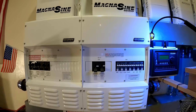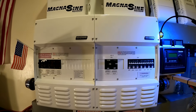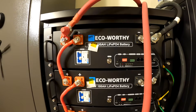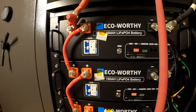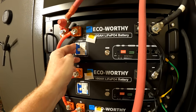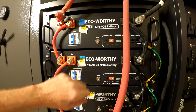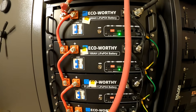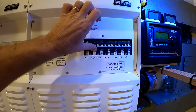Hopefully I'm not missing anything. The next step is to go ahead and try to crank this thing up — this never boots up easy. The way I do it is I open up both inverters so we can use the charge resistor to limit the current when you first turn it on. It usually takes two or three batteries to start those two heavy copper-wound inverters — they don't like to start up too easy. Let's pop three of these on: one, two, three — quickly, two at the same time, then the third. Come on baby!